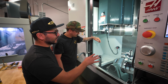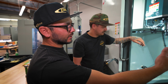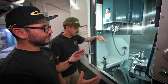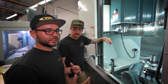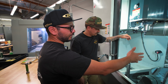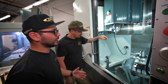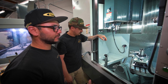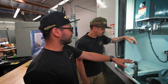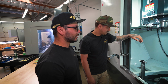The biggest thing with this was we wanted to make sure that all of the mechanical features, meaning the tie rod mounts, the lower control arm mounts, the uniball, the snout, the brake calipers, all of that's machined on the first operation, so that all the true positions and their locations are exactly where they have to be. And then when we turn it around to finish the material removal, it's just taking out the excess material. There's no other feature that needs to be done other than pulling the material out. And the fact that we could do all of that in one shot on the 5-axis is astronomical, the amount of time that we've saved. So that's pretty much it.